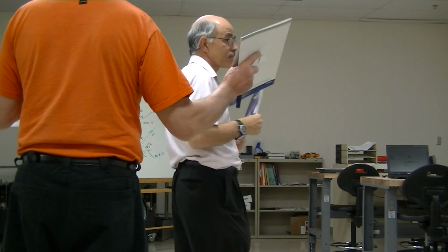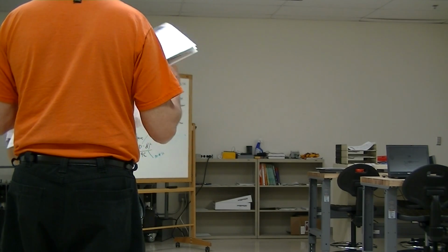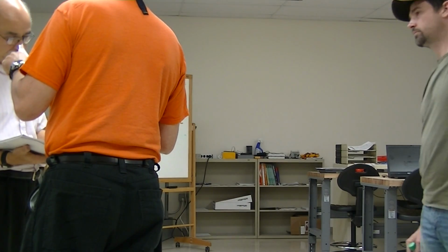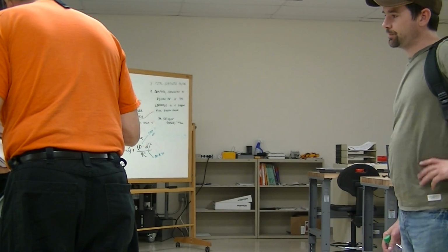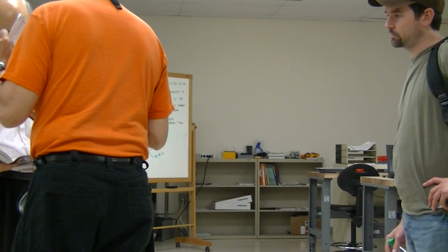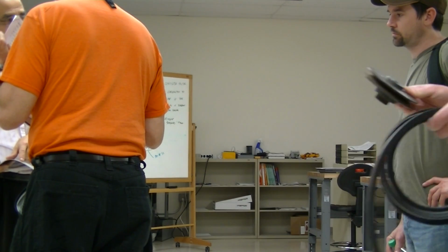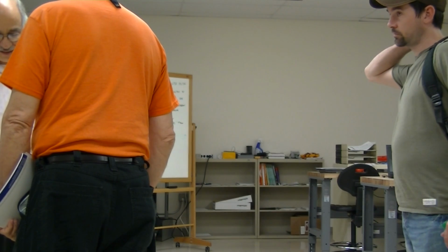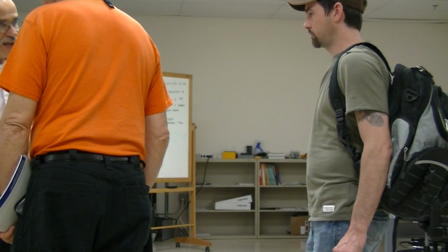See, this is good for the team. It's everything that we've been going over for the first couple of weeks. It is a nice document. One of the things I really liked about it is that it shows how the different devices compare. If you use the thumb test that 90% of technicians use, you're going to have about 65% accuracy in determining that the tension of your belt is correct. If you use the plunger like we have, you're going to have 90% accuracy. If you use the frequency tester, which is this thing, you're going to have 99% accuracy.